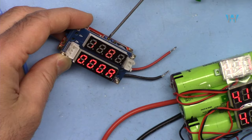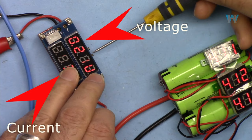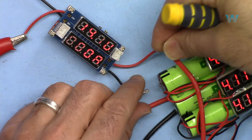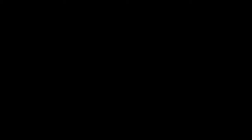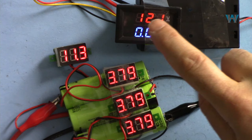Here is a quick example of how to do the charging. I'm setting the power supply to 14 V — done. Then set the current: short the output, set 2 ampere, then disconnect. Now the supply will not allow above 2 ampere. Connect the battery and pay attention to the current — it shows 2 ampere, constantly charging. Now I've set the voltage to 13.3 V and current to 1 ampere; it will slowly charge and the system will automatically stop it.